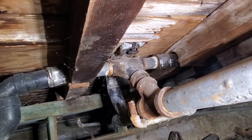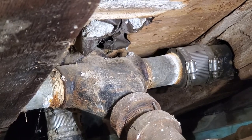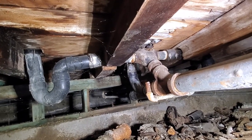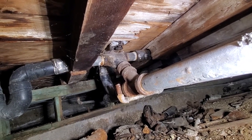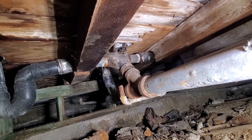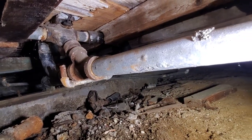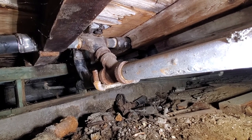As you can see, that's the vent right there. And behind that, that's the kitchen drain. So instead of tearing open a bunch of walls — this would be a major job to access that vent for that double fixture fitting, and there's literally zero space to cut down here — I'm going to cut this out, run the trap to right here, and put an air admittance valve on it.